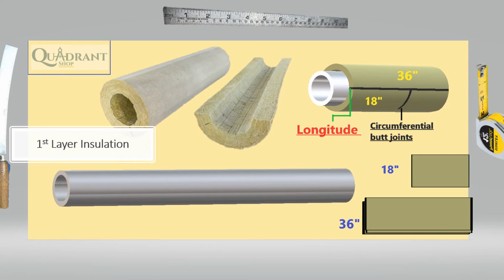Also, dry insulation is protected until waterproof. So if you already start insulating the pipe and you have to continue the following day, you have to put some type of protection on it. You cannot put metal, right? Because it will make no sense, putting it on to take it off. But you could put some polyplastic on it that is good for the weather until the next day, right? Flanges, valves, and supports are correctly insulated and staged.